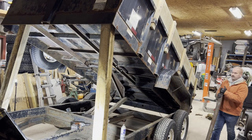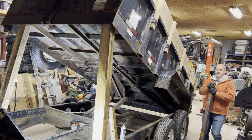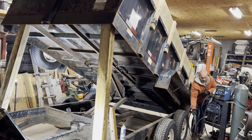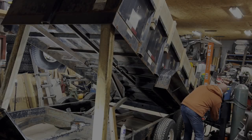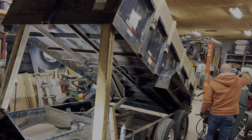Okay, so once the square tubes were tacked and welded in place and I knew everything was safe to crawl underneath and take everything apart, I went ahead and removed all the bolts from the base plates and lowered the scissors lift out of the way to access the pipe collar and the shafts that were in both sides. The right-hand shaft slid right out quite easily. The left-hand shaft, as you'll watch, was quite a pain to try to get out of the collar.